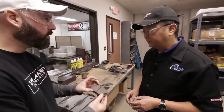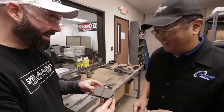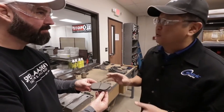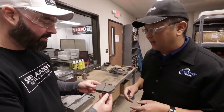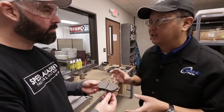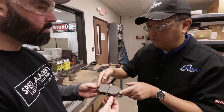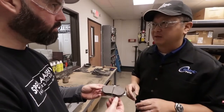So this is what your finished prototype looks like. You've actually put a retention clip on there to hold it in the caliper. We've got to think about how we're going to test it — it actually has to fit in a production caliper in order for us to test it on the dynos. Any additional features needed to make the caliper function correctly with the brake pad — something like a retention clip, the chamfer on the side of the pads, the slot in the center — all those features have to be done during this prototyping stage.